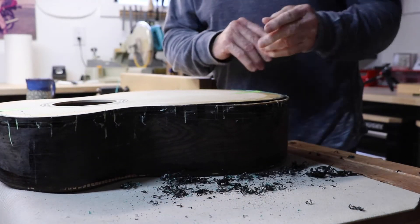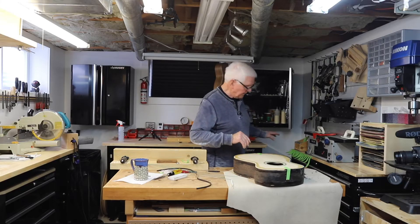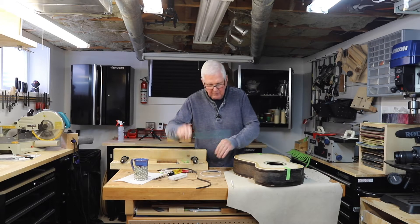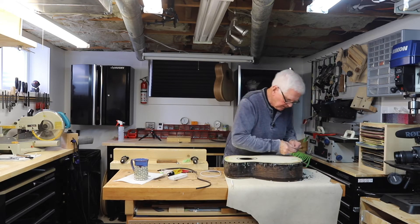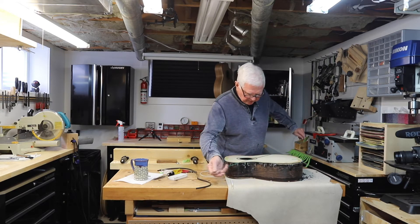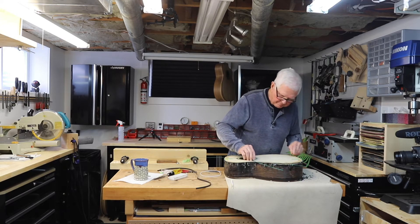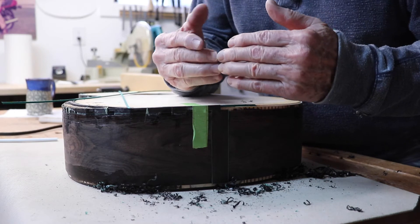I have already made up some tape to save us some time. I've got about 15 to 18 pieces — we had 25 around here — but let's see what we end up with. We're going to start by placing the purfling in here like this. Now another thing I want you to notice — this is a small detail but it's an important one. When it's cut at an angle you don't get to see very much of the top because it just blends in too well, as opposed to a straight cut where you can see where the two pieces join together.